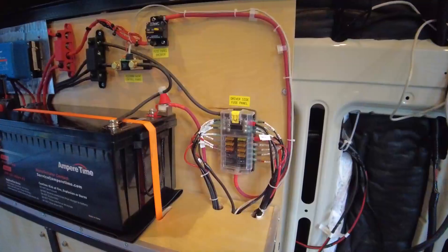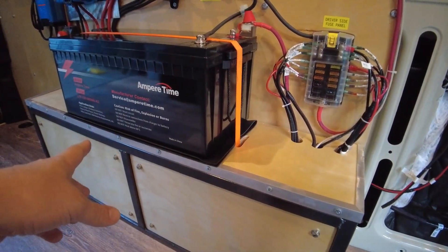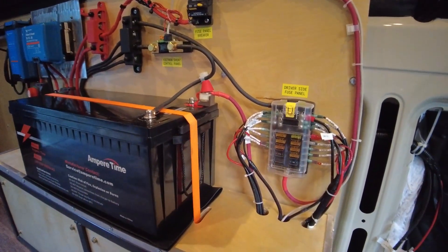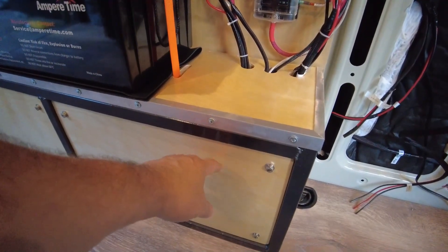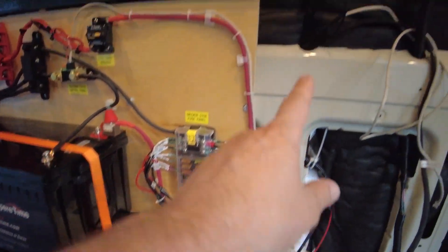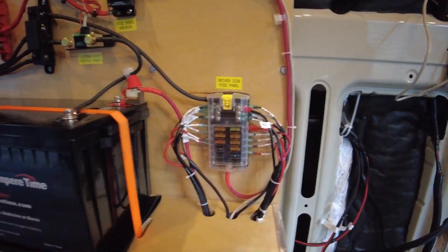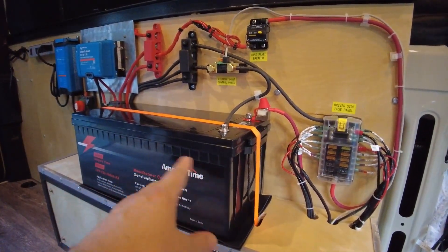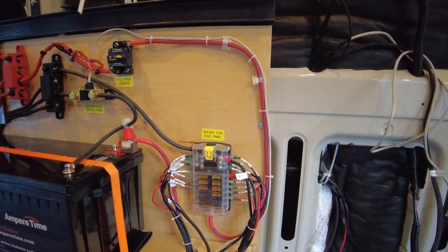So the next priority is to get the control panel — just a piece of wood I can mount the monitor to, plus some other switches. But let me show you what I got so far. I built this box here — it's made out of thin-gauge 1-inch tubing, 1/16-inch wall, so it's pretty thin and light. It's got little pieces of plywood with welded nuts so they can be screwed and unscrewed. All my wiring drops into this box and I can feed it up through holes here. I made the box big enough to potentially put two batteries on here if needed.